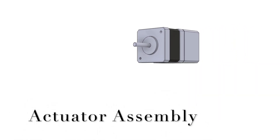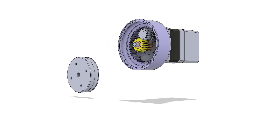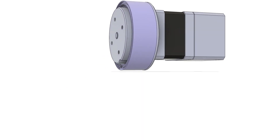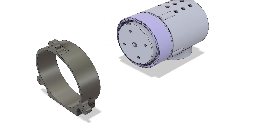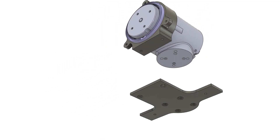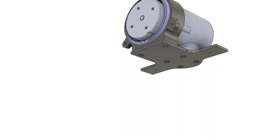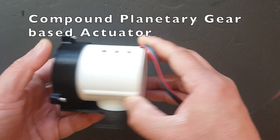The actuation and mounting scheme that I had been using did not appear very scalable, so I got back to the drawing board for a way to make things modular and therefore easy to scale. Here's what I came up with: number 1, a compound epicyclic gear train, or a compound planetary gear set, to reduce the speed and increase the torque in a compact form factor. Incidentally, this is something I already had with me as a leftover from building a robotic arm.